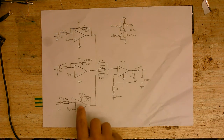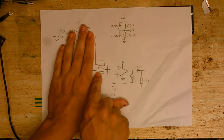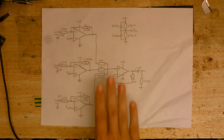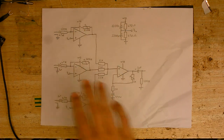I've got these three op-amps here to buffer the input. I could have just gone with having a potentiometer at each thing I want to mix — just omitting this and connecting the three inputs to variable resistors. The thing is, if I turn one up or down, it's likely to affect the level of the other two. This way, there's absolutely no chance of adjusting any of these levels and having it affect the others.